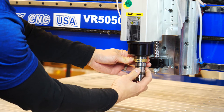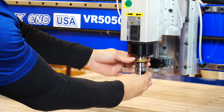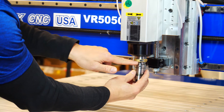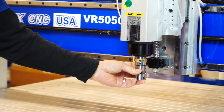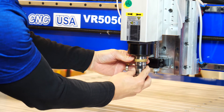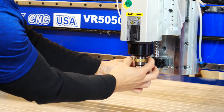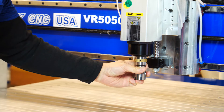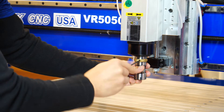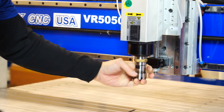If you don't do it right, you'll see a bigger gap — like a sixteenth or eighth of an inch. It feels like it's going in but there's a bigger gap, and it won't lock if you have it wrong. If you can't access that hole, put the tool inside and then rotate the brass ring until the set screw is exposed.